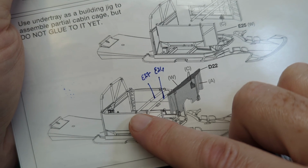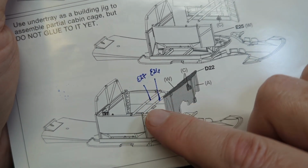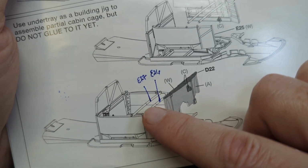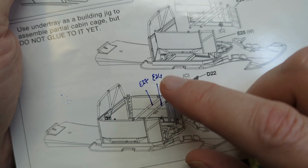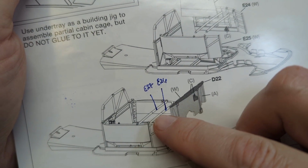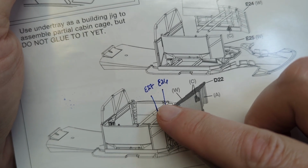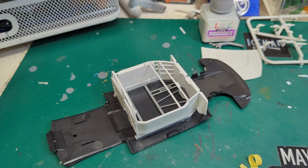We had to drill out the holes just a little bit on these pieces here, on the side pieces, in order to accept the pins that were coming off these rods. The rod seems like it might actually be sort of keyed. We'll show you here on the part in a second, but we just had to keep rotating it until it sort of dropped into place, and that was great. But yeah, we had to chase the holes a little bit.